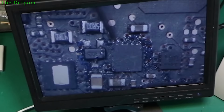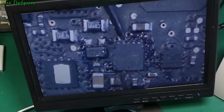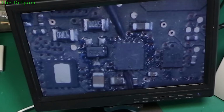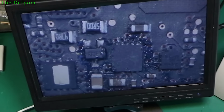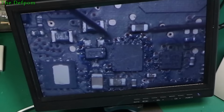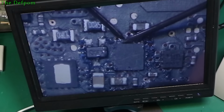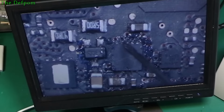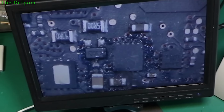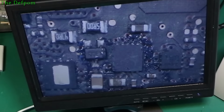So if I go from the via itself to this pin as well, nothing. So the via seems to be dead. I haven't tried going from the via to the actual pin there though. Let's try that. Yeah, okay. So it looks like the via through the board to here, or maybe underneath that. I don't know, it might go underneath, but I've got voltage there though, so I'm not quite sure what the story is, but there's no connection there between 4 and 7.